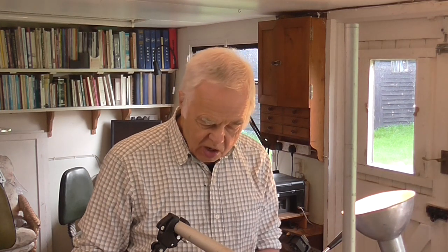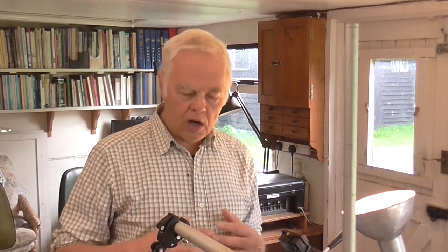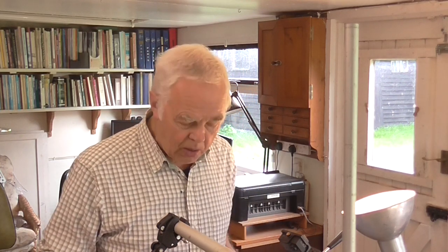Naturally, the faster the blade is going the smoother the cut, and the slower the blade the less smooth the cut, so there are drawbacks. But in most cases, especially with a reverse tooth blade, it's not really a problem. When you're a beginner cutting thin wood it is much more difficult than cutting thicker wood. A good tip is to stack cut - even if you only want one copy, it's worth putting two or more pieces of thin plywood together. That makes it a bit thicker, the saw is less likely to rip through it, and you get more control.